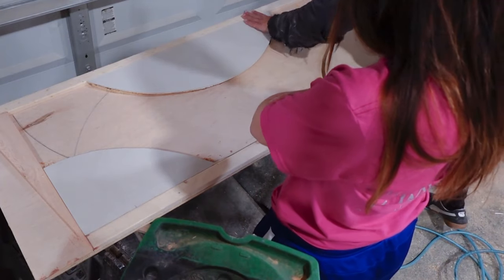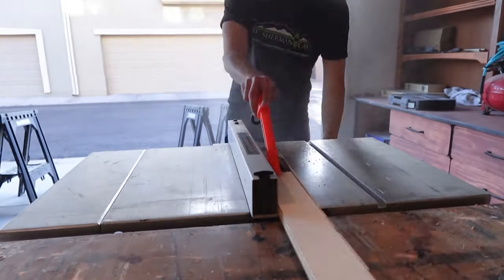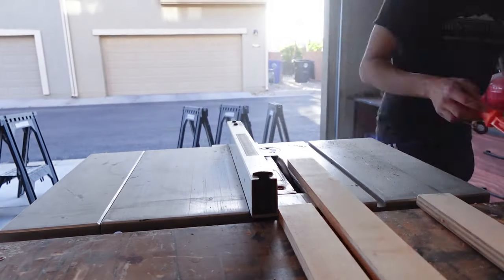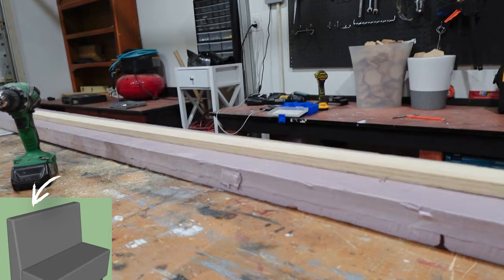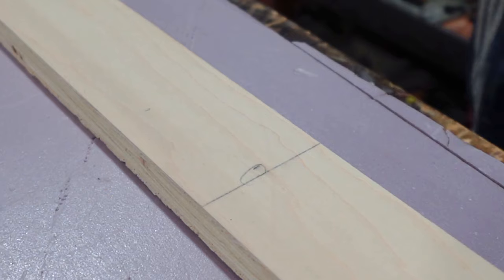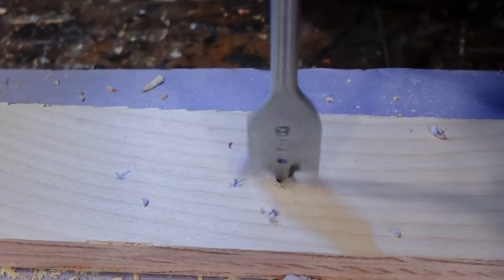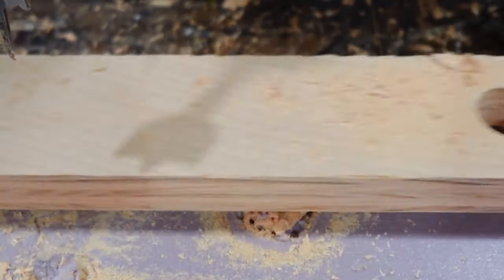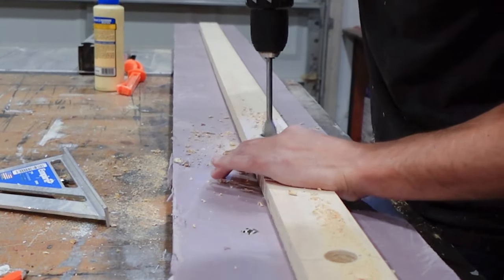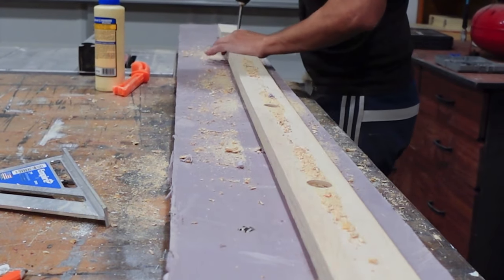I made the same pattern on the smaller section of the bench, just with one less arc. I then ripped down a couple of boards of three-quarter-inch plywood for the very top part of the bench, where I wanted to put recessed lighting to light up the corner of the kitchen. These are mini recessed lights about seven-eighths of an inch wide, so I used a hole-cutting drill bit to drill out the holes, spacing the lights about 14 inches apart.